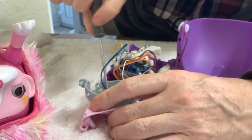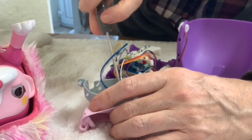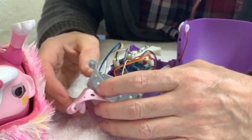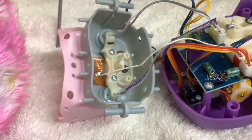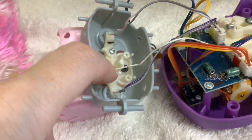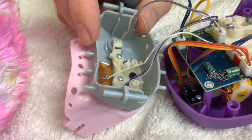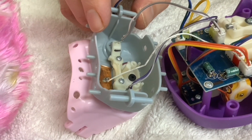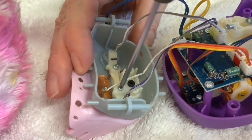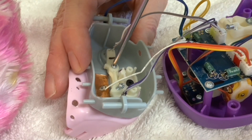You want to take the switch out. Then take the screws out and desolder the wires to the diode and touch sensor. Those two screws there look like they hold down plastic brackets to keep the LEDs in position, so we'll take those off. Well spotted — to keep the LEDs in position.